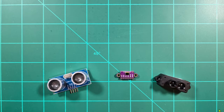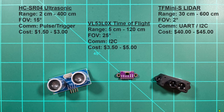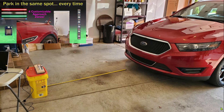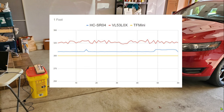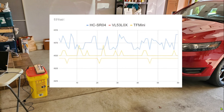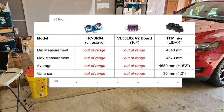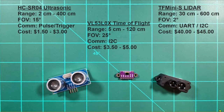Looking at all three distance sensors side by side, the ultrasonic and TF-Mini have a similar range — so why pay so much more for the TF-Mini? The key difference is accuracy and signal stability. In my parking assistant video, I tested all three sensors side by side for accuracy and stability at various distances, and by far the TF-Mini was the most accurate and most stable. If you don't need that high accuracy and stability, there's no reason to pay the extra cost — an ultrasonic or time-of-flight sensor may be just fine.